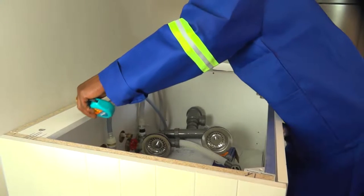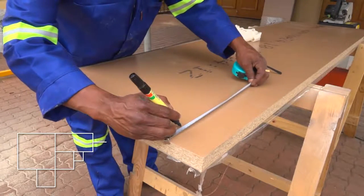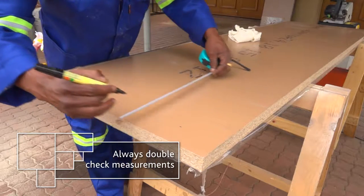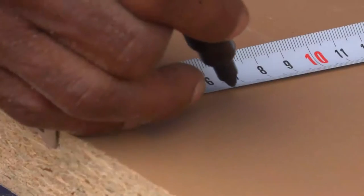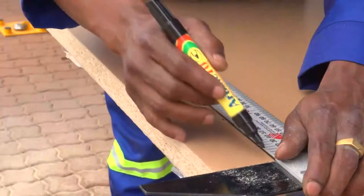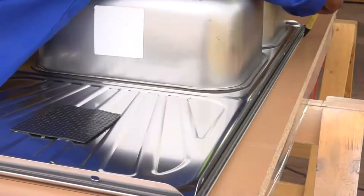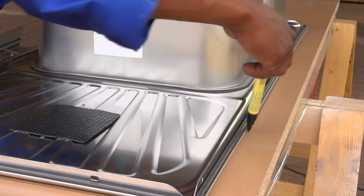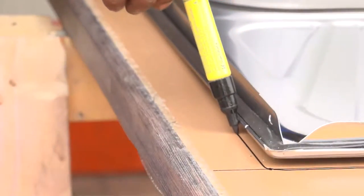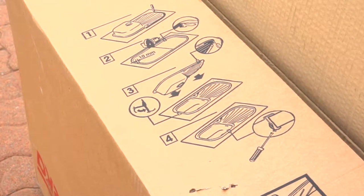Let's talk about making cutouts and inserting a sink. The first step is to measure and mark at the underside of your worktop, so you know exactly where the cutout needs to go. You can use a paper template to draw the cutout shape, or if you're making a cutout for a sink, you can position it on the worktop and trace around it.